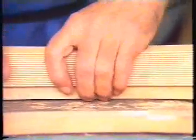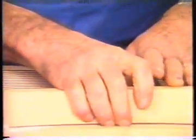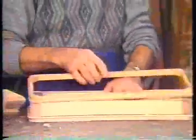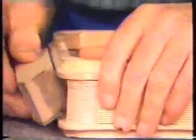Art and technology go hand in hand during the construction of Fantini accordions. The construction of the bellows is a valid example of this. This starts with the assembly of the cardboard strips, which are cut to size and bent. The four pieces making up the perimeter of the bellows are then glued.